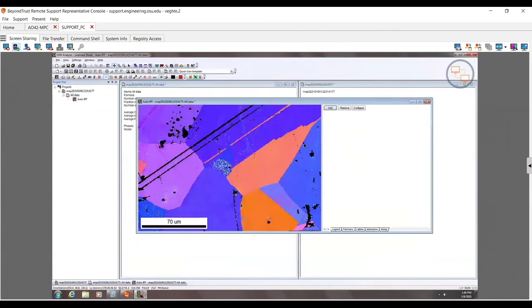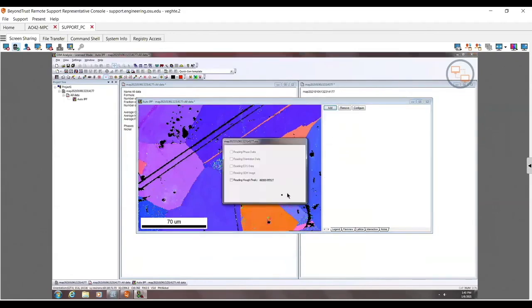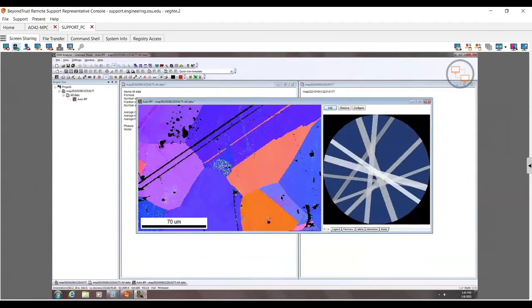I don't think I see the patterns with this. Yeah, I didn't save the patterns. Just trying to figure out why it's bouncing around between two solutions. And it's because I used that bad background, or no background, with the damaged phosphor screen. It's picking up bad lines around that, which is why it's doing that with this guy.